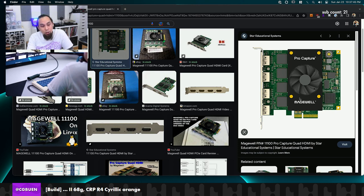And what's terrible about this is that the fan is connected via a 2-pin 1.25 millimeter JST cable directly into the board. So the board is controlling it. And the thing that I learned is that every driver except for the macOS driver, since 2019, just runs the fan at 100%.